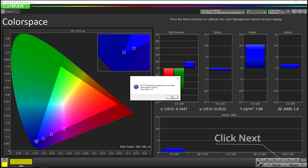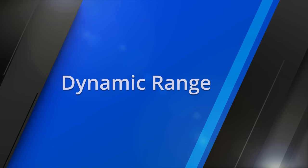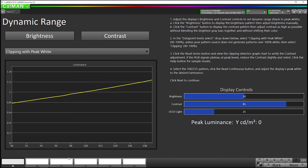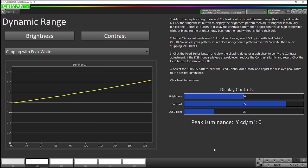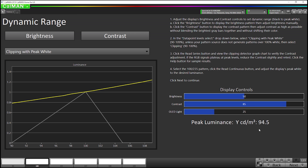The Lightning LUT is now complete. Now we're going to check our luminance. I'm going to click here — 100% white — do a single reading. We're getting 94 nits, so I'm going to go up one click, re-measure. One more. Okay, perfect. Next step.